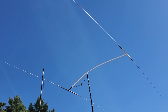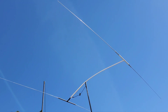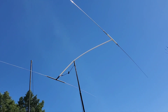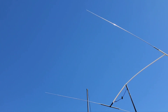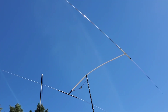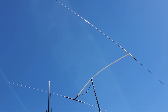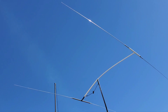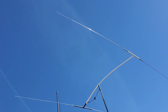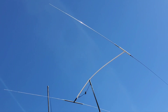Today's video covers a two-element homebrew beam made from four telescopic whips, a spider beam pole, and some PVC. It's currently set up for 10 meters and working outstanding. The two elements are separated about eight feet three inches apart. The driven element per side is 103 inches, and the reflector element is 107 inches per side, so the reflector is around seventeen feet total.